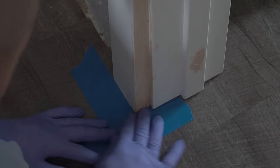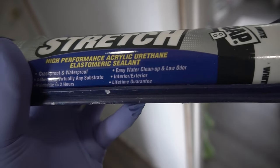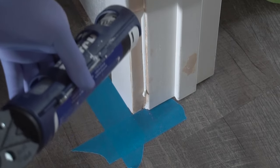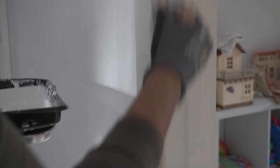Before we caulk, we're going to put down good masking tape. I use DAP Extreme Stretch caulking — this is my preferred product for interior caulking, and it works for exterior as well. I'll leave the link in the description. We're just going to apply the caulk for a nice smooth transition from what I built up to the door casing. Take off the excess and finesse it. When you're done, it's time to paint and apply that first coat — use a brush on those sharp corners to make sure you fill everything really well.